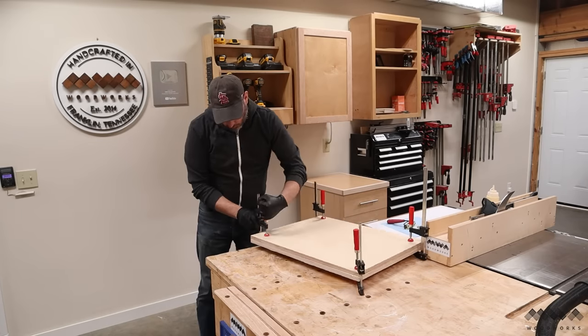Another thing I wanted to address is dust collection. That's a sore subject when it comes to drill presses because it's very hard to get good dust collection here. I think I found a solution that was really easy to build, is pretty effective, and I can get it out of the way easily when I don't want it. To make the dust collection attachment, I start with a small scrap of ply, find the center, drill a through hole, and glue in a small length of dowel. I then add a velcro tie-down using a pan head screw, and bore a corresponding hole in the drill press table. The attachment fits in that hole and the tie-down wraps around my dust collection hose to hold it in place — if I need to adjust, I just loosen the strap and move the hose. Testing it out: using a Forstner bit, it gets a pretty good amount of the chips, and when I use a twist bit, it pretty much gets all of it. Looks like this solution really sucks!